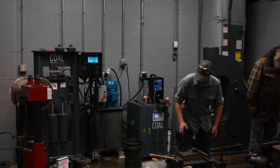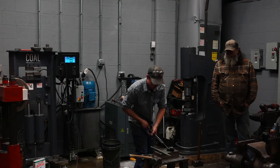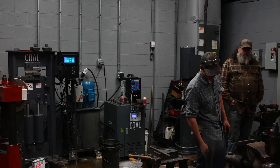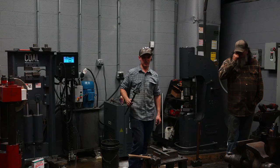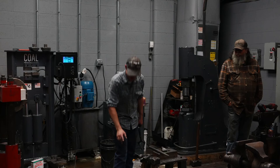Between every heat, you're gonna notice I'm setting my anvil back up. That's something I think is important, and I like to see people doing, no matter whether they're making something for the 100th time or the first time. I like to see people knowing what they're gonna do in the next heat, having an idea of how they're gonna do it, and setting their tools up to do it. And not, you know, a minute ago I came over here with the billet and this was on the floor. Okay, that's wrong. I should not have done that. This should have been on the anvil. Actually, the striker is supposed to set up the tools, but.